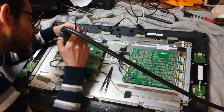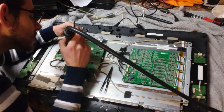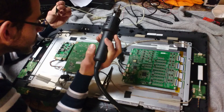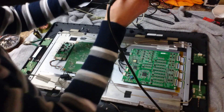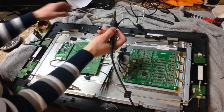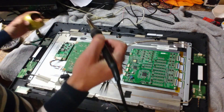Give me a second, gotta focus. So I usually set it down on the pins while everything's still hot, then push it down gently with my tweezers. Give it a little more of a blow with the hot air, then take the heat away, move the tweezers down, check that my pins are oriented properly, then go over with the soldering iron. Now it's time for the soldering iron to shine. I dab a little bit of fresh solder on there — but do it somewhere away from your PCB, unlike me.